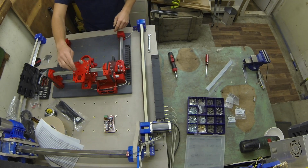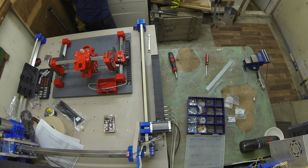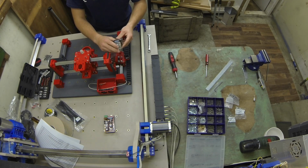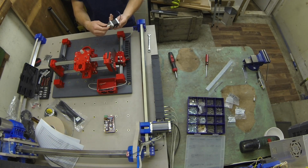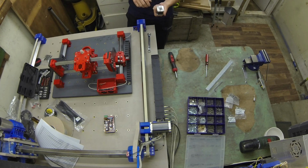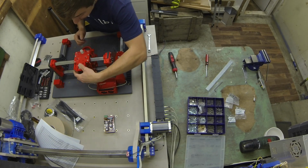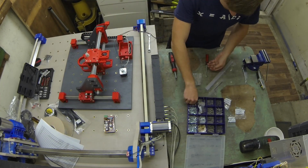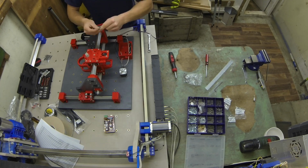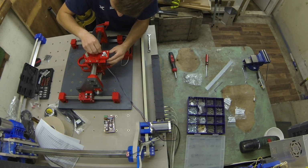I think, should we get the Z-axis on? These are just Wantai stepper motors. I could put a number in the description of which ones these are. Good motors these are. I've bought a couple of these from that company and am very happy with them. Yeah, you need the M3x12 screws. Now I'm going to have the cables exiting this side because I know my drag chain is going to be on that side as well.